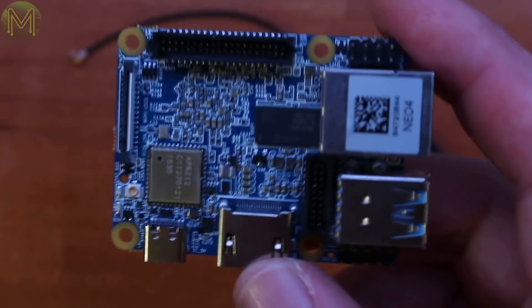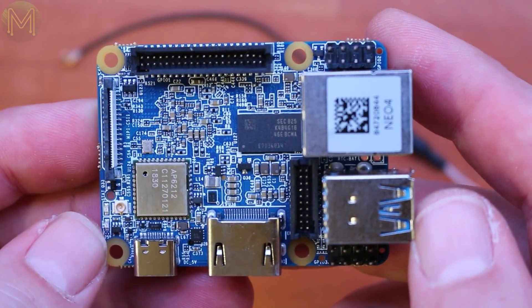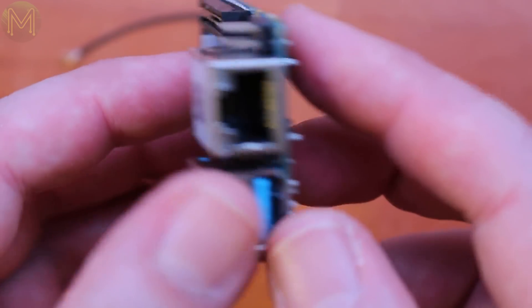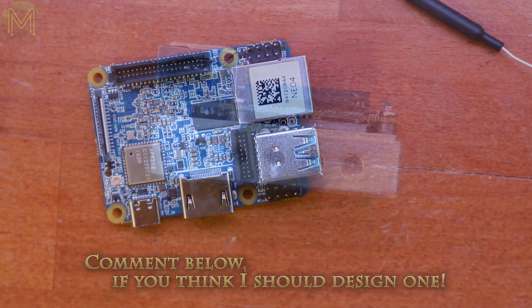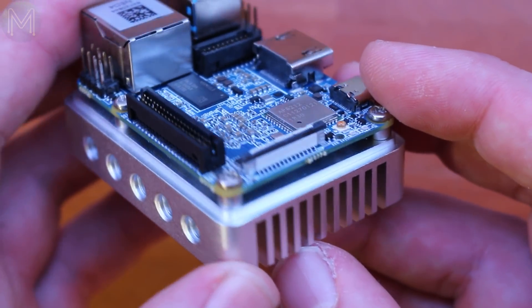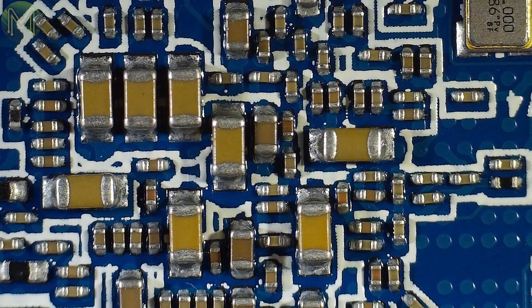So, what do I think of the smallest RK3399 SBC? Like all FriendlyArm SBCs, you're getting pretty decent quality for the price. Since they are listening to makers' comments on what to do right, they are one of the better SBC companies around. The size is great, but that 1mm pitch GPIO header is a bit of a problem. However, with a small adapter PCB breaking out the PCIe signals, this would be a great pocket server. The heatsink is a little too clunky and needs a fan, but apart from that it is a well-designed PCB — there really is no room left to add any more components. Thanks for watching, and see you next week.